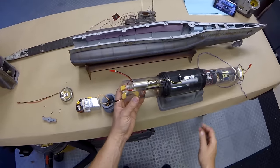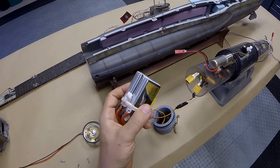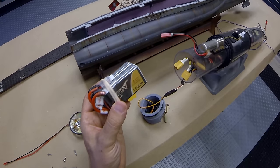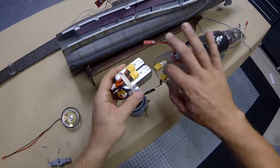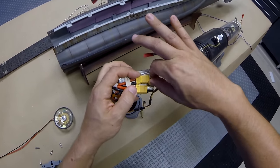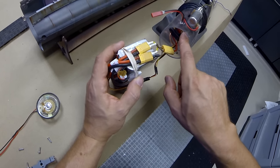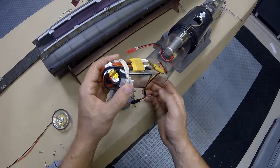Moving to the front, what we've got here is the main drive battery. This is a pair of lithium polymer batteries, 1300 milliamp hour capacity, rigged in parallel for 2600 or 2.6 amps — should be plenty of running time. We're going to start by connecting the power leads, and there's a 10 amp fuse in here. If anything shorts out, that fuse will blow first before anything else.